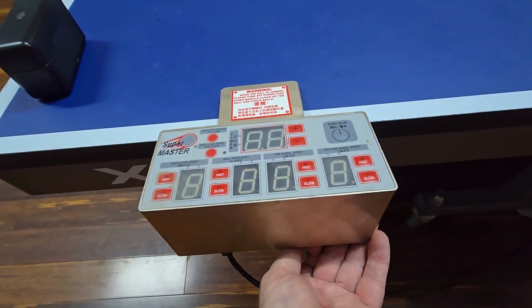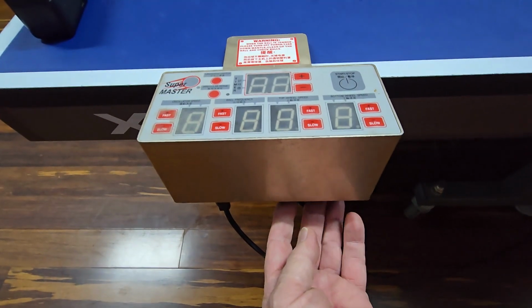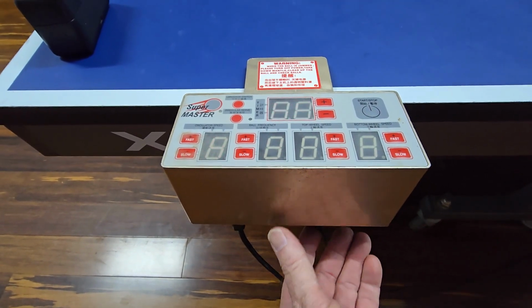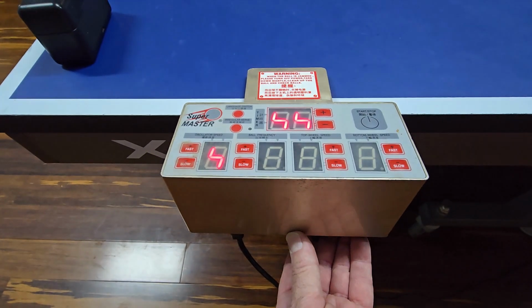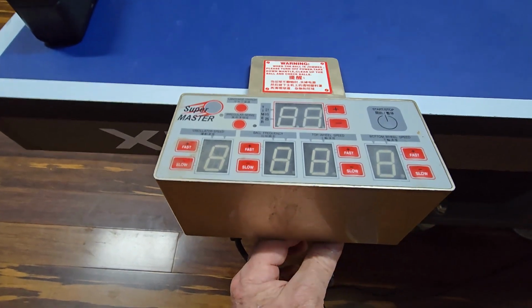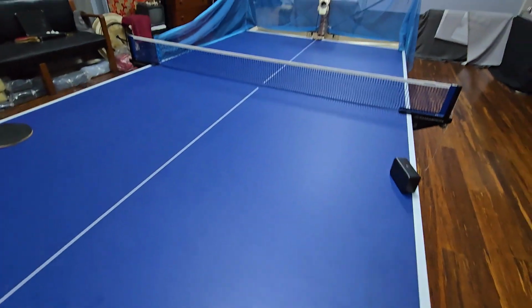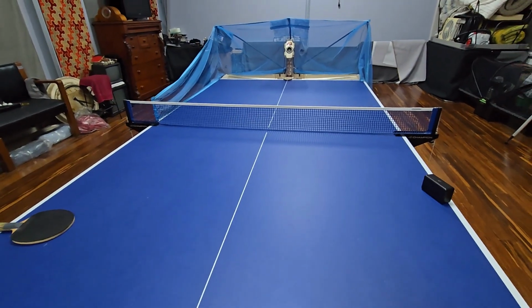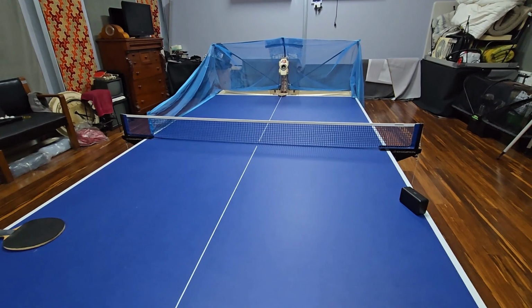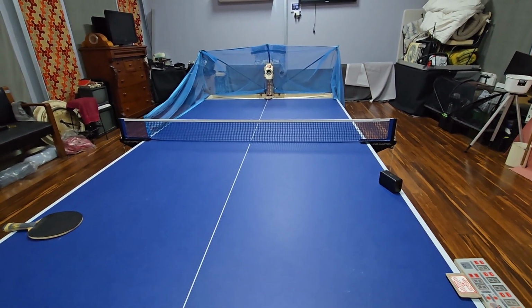I did notice we had issues when I first plugged it in and I had to wobble the plug, but if I touch the power plug, it stops. So I think it's got a bad, no, it's not even going to go now. All right, so I need to look at that before we finish up. There's definitely a bad connection in there, so that'll have to be fixed as well. Okay, it will stay on long enough to make sure all the other functions of the robot work, so we'll have a few shots with it, test out the backspin, the top spin and the oscillation, and then we'll go and sort that power supply unit out, but pretty well it's right to go otherwise.